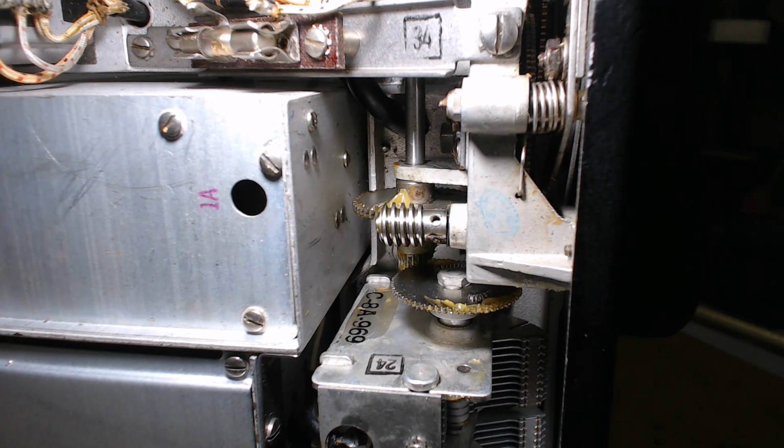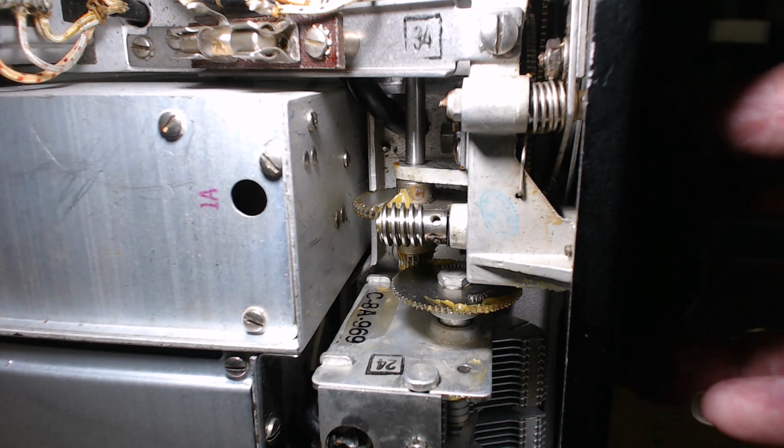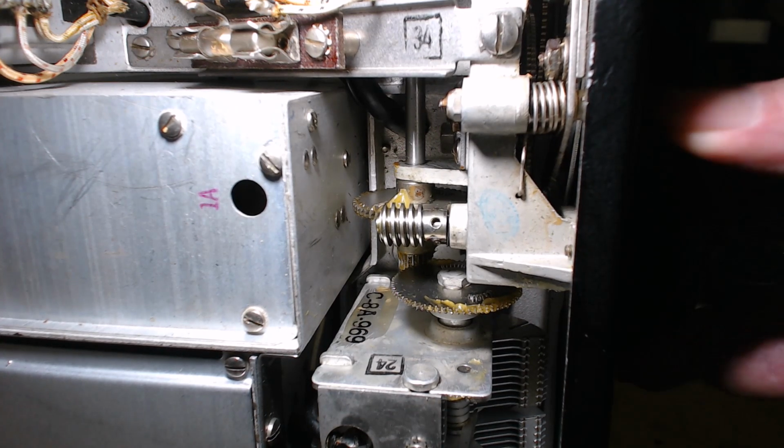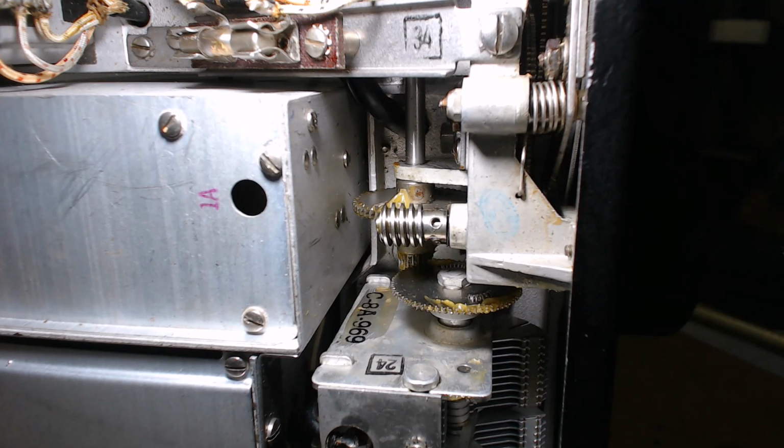They're two gears pancaked together, and there's a spring. When you look in there, look it over, and you'll see that that gets rid of the backlash. It's a trick that they've been using for years on radios, and the better radios use anti-backlash gears. So when you move this worm gear a tiny bit, everything moves with it. There's no hesitation, where you keep moving the knob a little further, then it moves.